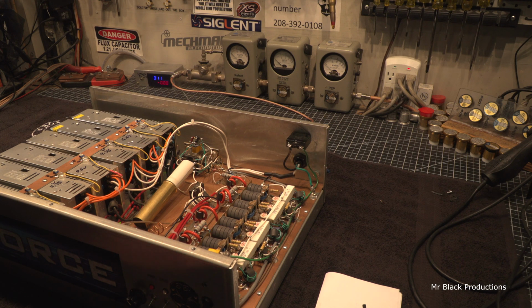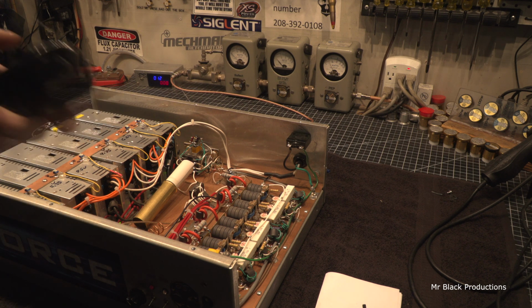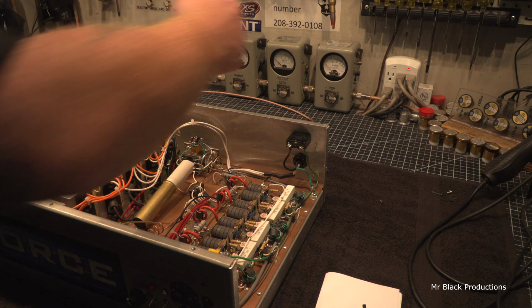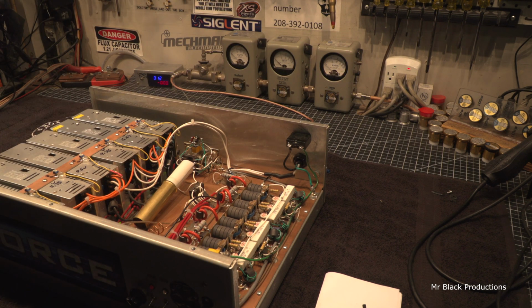Preamp is working, sideband delay light's working. Let's see if this thing keys. It keys. Hello, audio. Making good power too. All right. We'll go up to 2x since we've exhausted the 1000 watt scale. We pinned it in the corner. Hello, audio. Turn the variable all the way up. Pinned it in the corner. Okay, so we're making 2,000 watts with about 15 to 20 watts worth of drive.